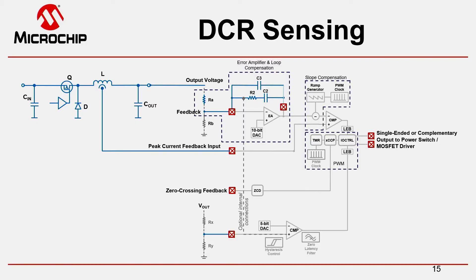Now in section 3 we will add custom features. The major goal of this session is to change our current feedback signal from traditional current sense transformer feedback to a custom designed DCR sensing circuit. We do this by diving a little deeper into the configuration capabilities of the parts, utilizing the switch mode power supply libraries to make fundamental changes to our feedback signal by adding custom components required to make this DCR sensing technique work.